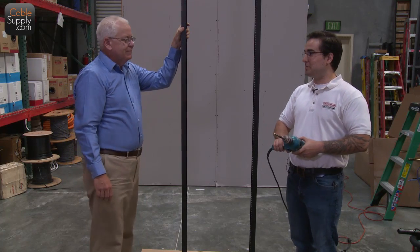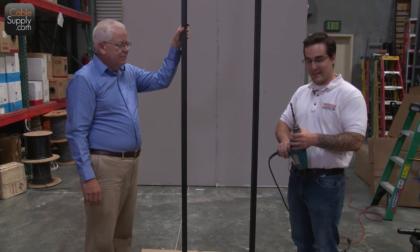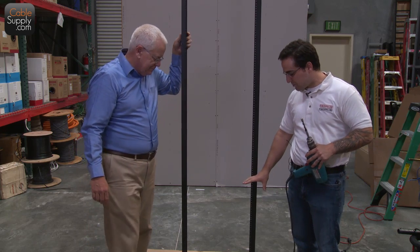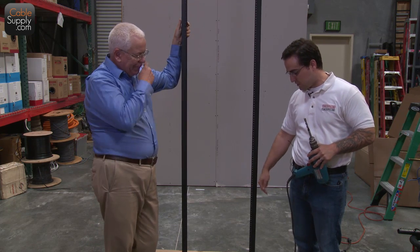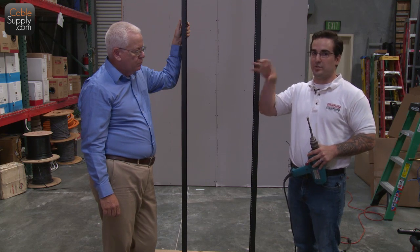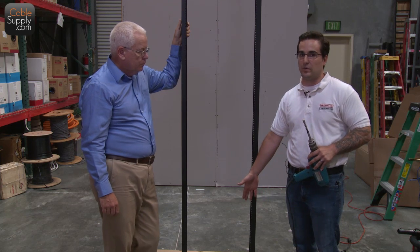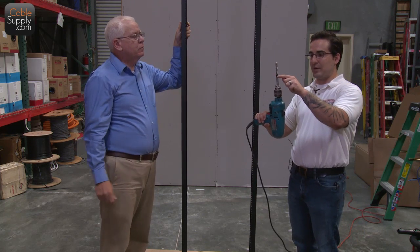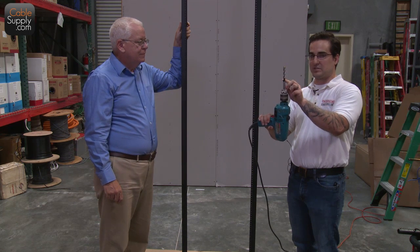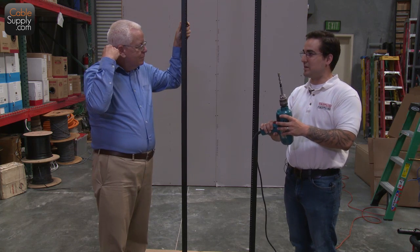Really the only reason I got invited out here was because I have a trademark technique for marking drill bits. The issue is we don't want to drill farther than we have to down in the concrete — whether it's into a wall where you don't want to blow out the back, or in this case we don't want to drill all the way down into our concrete floor. So what this is, it's the O'Hearn wrap. I've measured exactly where I wanted the drill bit and wrapped it with a piece of electrical tape. Make sure you don't ever use that term, of course, because it's trademarked.